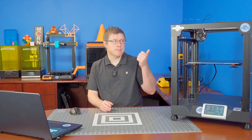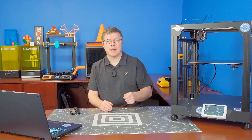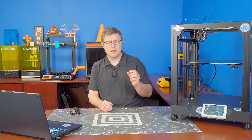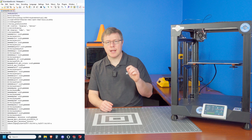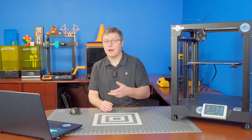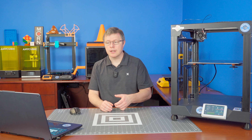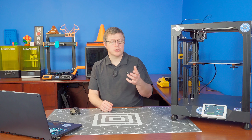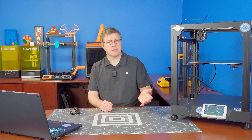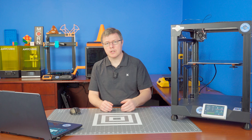The last hiccup being that my accelerometer — it is a BigTreeTech ADXL, but it's version 1, so it uses an SPI interface. It is not recognized by the Pi, and according to their website, it doesn't have an SPI interface. But in the environment configuration, there are some SPI options, but they're for overlays. I couldn't find any specific SPI plugin or port, and I expected them to go through the GPIO like on the previous version Pi or on an actual Raspberry Pi. I've emailed them about this and hopefully they will get back to me soon with a solution, and when they do, I will put that solution in the video description. For now, I just had to disable the ADXL in my printer configuration. Luckily I already had my input shaper values tuned, so I commented out the ADXL stuff and everything came up just fine, and the printer functions perfectly fine after that.